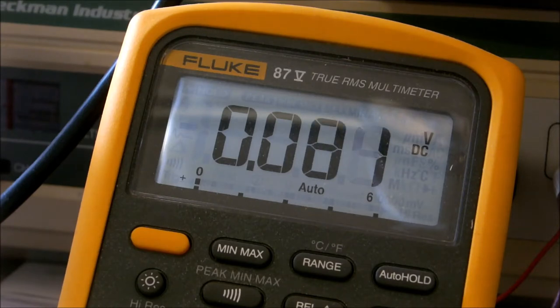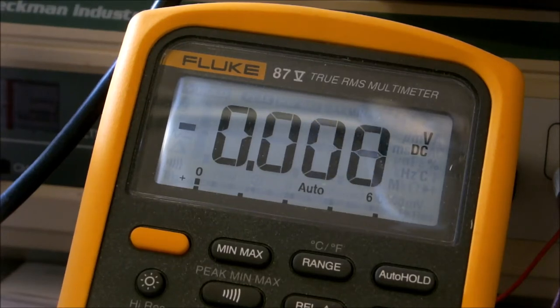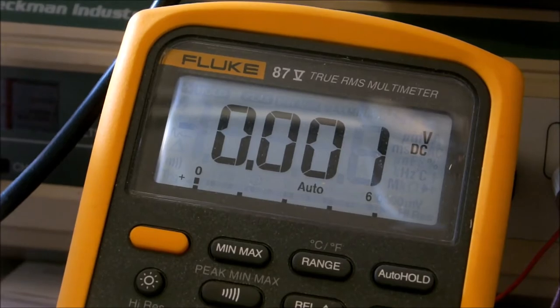Next test we'll do is check out our CPUs by loading the Arduino Blink program down to them. That all looks good. We're almost ready to go. We'll put our final parts in there. Got to get our GPS mounted in that socket, the 74AC14 Schmitt trigger, and our LCD so we can read what's going on. And we'll see what happens. Making progress.